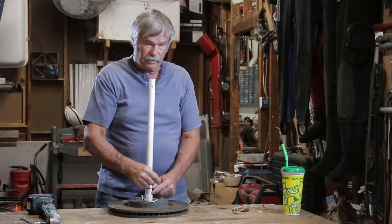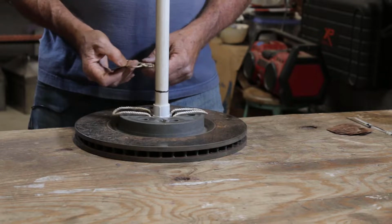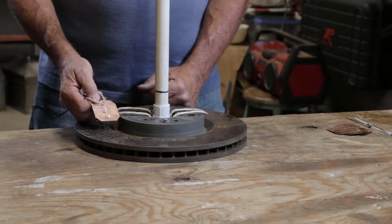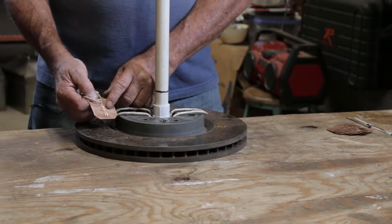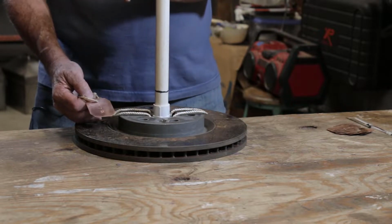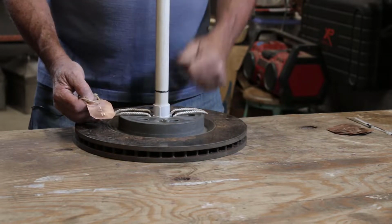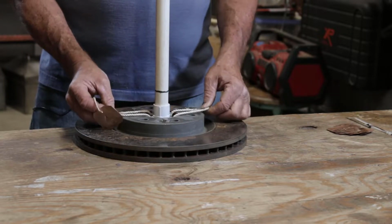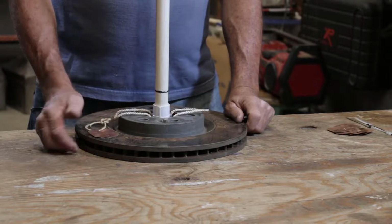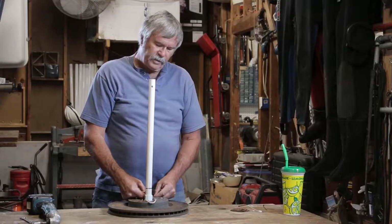I call them a trilaterator because you're trilaterating distances to various features on the wreck. Another thing that you want to do, and this is just so you know where you're at, is you have these little copper plates, discs that I have made up that have a number stamped into them. In this case, it's number 4, and the H at the bottom is for Henrico. So you know that if you just come across the wreck, you'll know, okay, I'm at pole number 4, and I'm on the Henrico side. Instantly, you're oriented. So you can have these tied to these rope ears, and that's also where you run a string from rotor to rotor along one side of the ship. And if one gets pulled over, something happens to it, all you got to do is find one, you can find the rest. So it's a good reference.